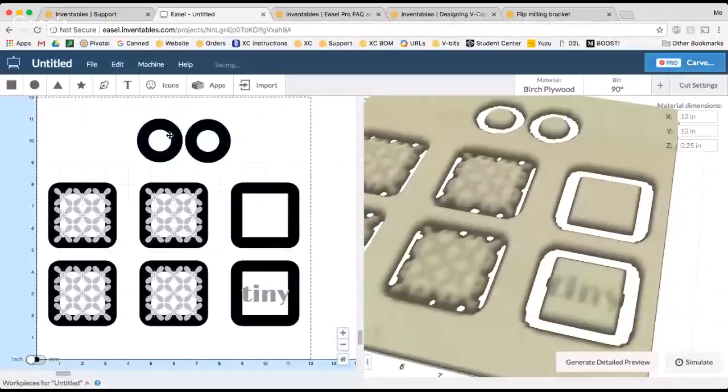Okay, so I got my knob, everything's lined up. Now the most important thing that I mentioned earlier is that it's very unlikely that the width of my material is really gonna be 12 inches. It just doesn't seem very possible. There's always variances in terms of wood and even some of the acrylics and stuff that we sell, there is a slight tolerance on a lot of those.